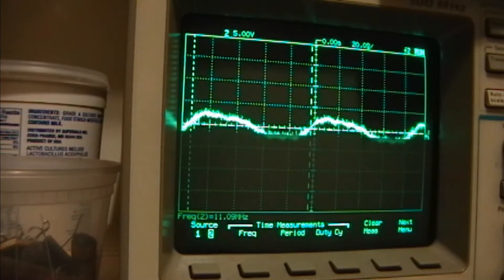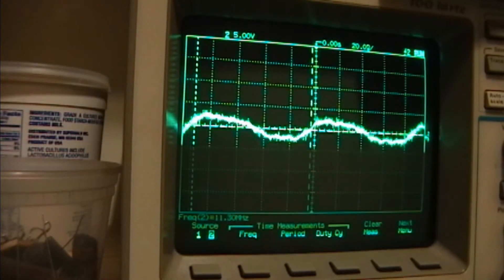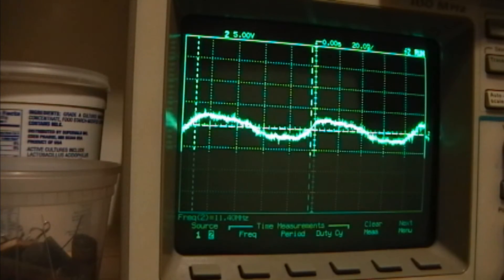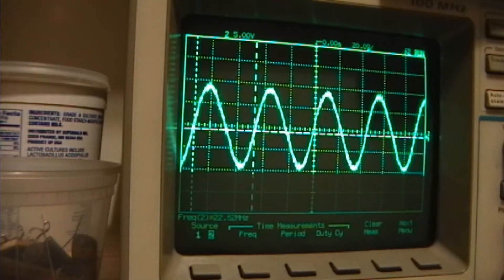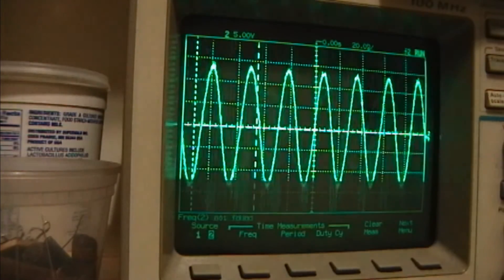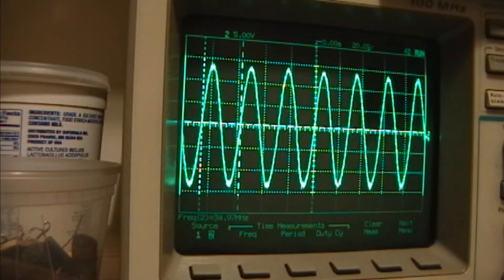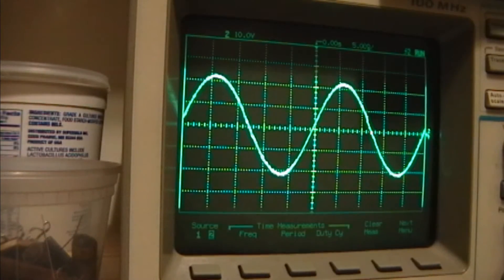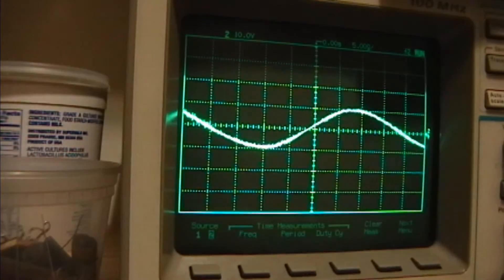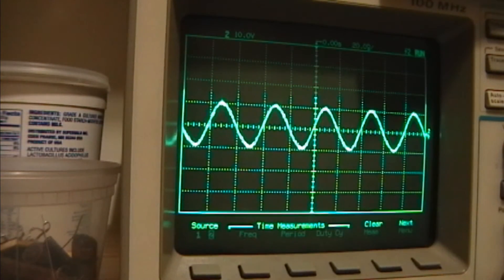There's 11 MHz. What I suspect is happening now is that even though the oscillator is doing 11 MHz, there's probably some kind of bandpass filter on the output amps that's optimized for the 35 to 50 MHz range, so that's probably attenuating the signal. Back up to 22 — it's not bad. I've noticed when I get it back to 35, the amplitude increases. There's some kind of filter knocking down the lower frequencies, but that's alright. There's 40 MHz — even higher and nice and clean. But down at say 25, it's a little bit dirty — but that's okay.